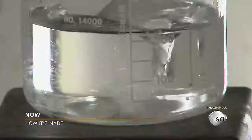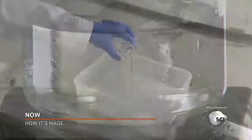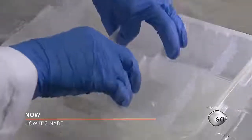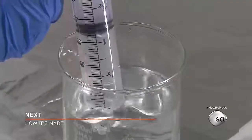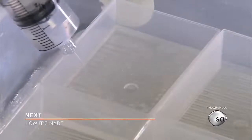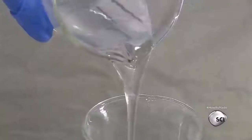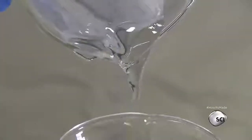The chemical reaction will also cause the mixture to become a gel. But before that happens, he quickly prepares the molds. He pours pure methanol over a plastic grid and arranges rectangular molds over the grid. He injects precise amounts of the silica gel mix into the molds and leaves them to gel. During this process, the methanol under the grid evaporates, preventing excessive drying of the gels.